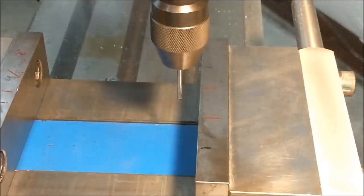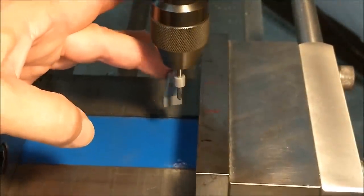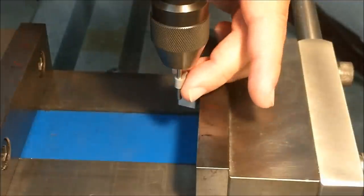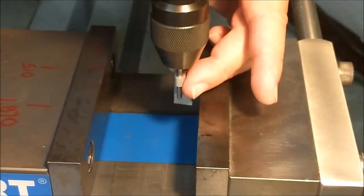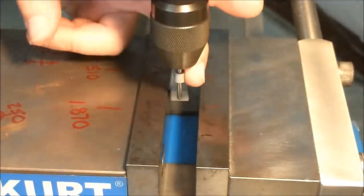With the appropriate size pin in a drill chuck, I am going to hang this piece off that drill chuck. And I am going to reposition the table around it until it squeezes tight. If all goes well, I'll be able to get a nice registration on that part. Get this going. This will not be the final setup for the repair. This is just for the bushing.